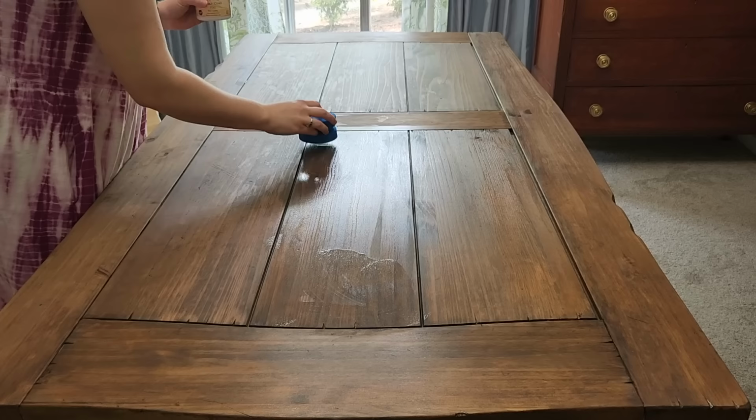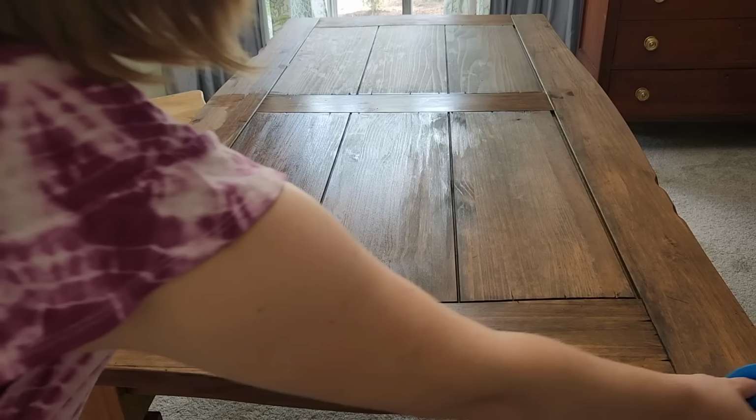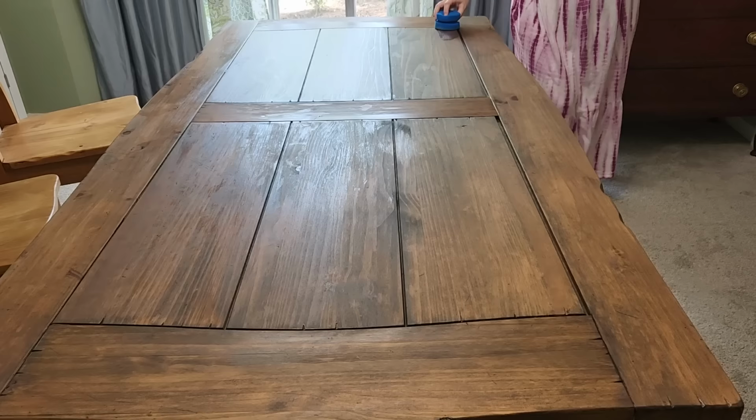And I guess on other pieces you could use an oil or some other type of finish. You can use oil-based clear coat as well, or you can use shellac, or you could use clear enamel. There's a lot of different options out there for clear coat, but my personal preference for a table that's going to get beat up, it's going to have water on it because of drinks and food and whatnot, use a water-based polyurethane. When it's a water-based one, you won't get those water rings like you would with a shellac because shellac, if it gets water on it, turns white very, very quickly.